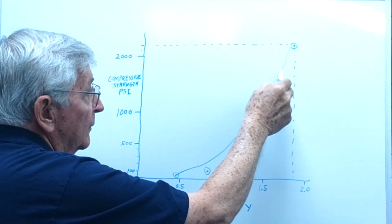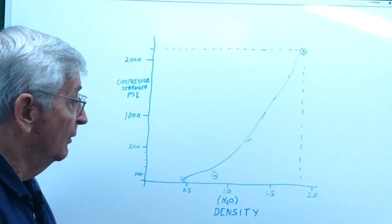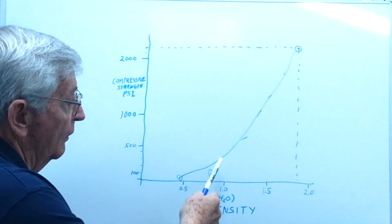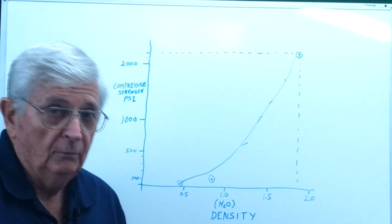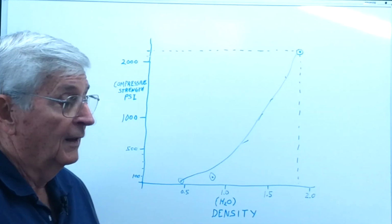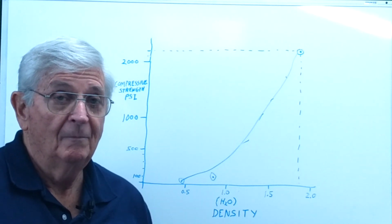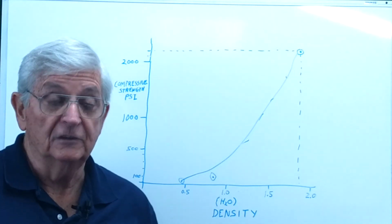So we really need to make some samples to get a better idea of the shape of that curve and get these points more accurate. So I'm going to have to make some larger molds for the low end here, and I think we're okay in the mid-range with the mold situation. But the real problem is everything has to cure for 4 weeks for it to reach a high percentage of its final strength. So sometimes science can be fun and sometimes it's slow and tedious.